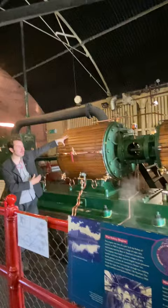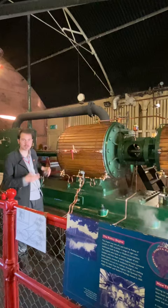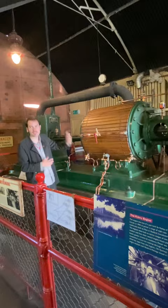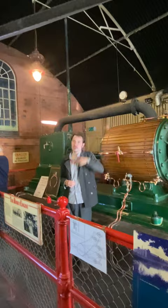Take a look in here — this is the low pressure cylinder. It does the exact same job as the high pressure cylinder, pushing the piston and driving in the same direction. You'll notice it's quite a lot larger, because as steam loses pressure it increases in volume, so to make sure we use all that energy the cylinder is slightly larger. The pressure goes from about 13 PSI down to about 5 PSI, which gives you a lot more energy and increases the overall efficiency.